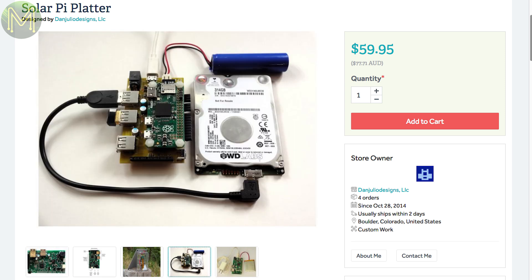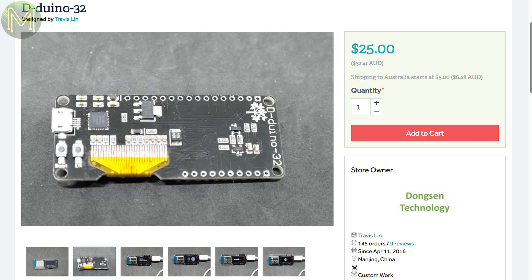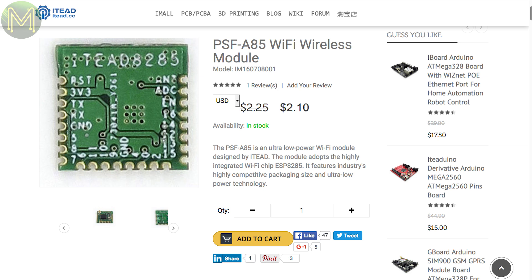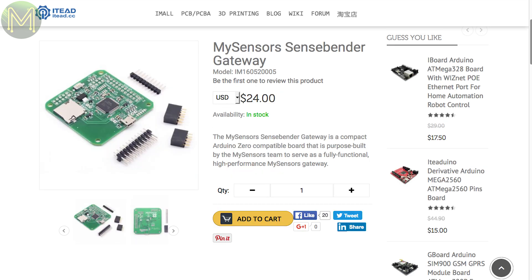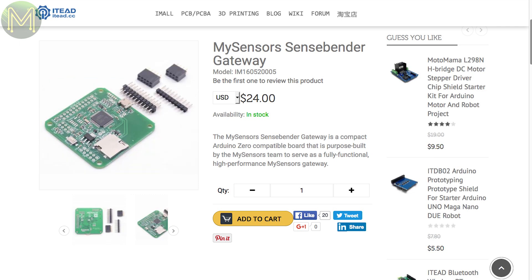This board is the outcome of a successful Kickstarter in 2015. The DDUINO32 is pretty much the same as the DDUINO with a small OLED, but this one uses the ESP32 instead of the ESP8266. There's also an ultra-low-power Wi-Fi module based on the ESP8285, supporting all Wi-Fi modes at data rates up to 460 kbps. This Arduino Zero compatible board can act as a gateway to sensor networks, contains a SAMD21 at its core with SD slot and USB, and can interface to NRF24L01 chips or RFM69 radios.